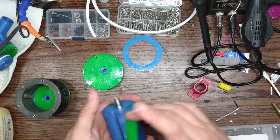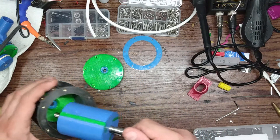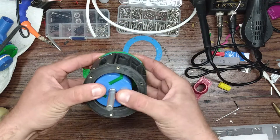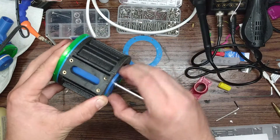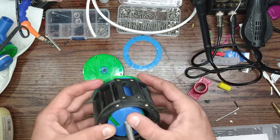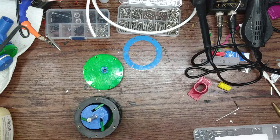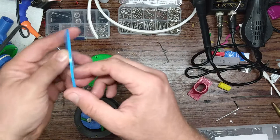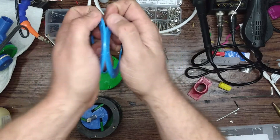Now this just goes in here. And you can see the offset there. I had to make a thicker gasket than the originals — this being the original. It's about half a mil thicker to compensate for me facing the ends down.